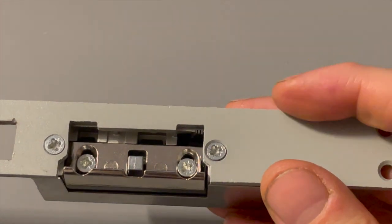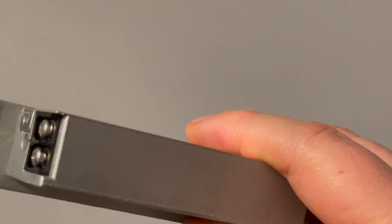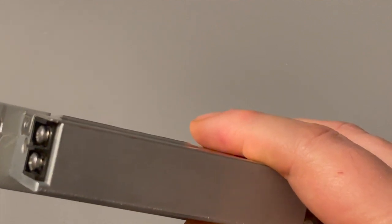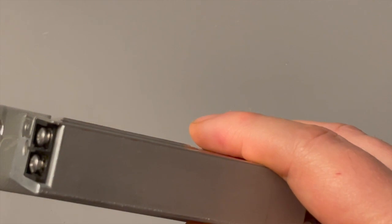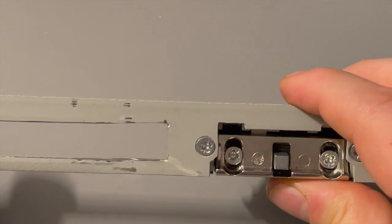Here is the backplate we'll be using. It's quite simple — it only has two connections for power and ground. It can run on anything between 12 and 24 volts and can use either AC or DC, so polarity doesn't matter. Mine didn't fit the deadbolt properly so I had to make the deadbolt hole a bit bigger using a dremel and a cutting disc. Time to bring out the power tools — this is perhaps the scariest part since I'll actually have to cut into the existing door.